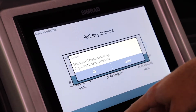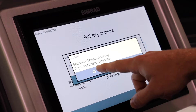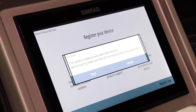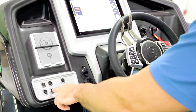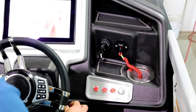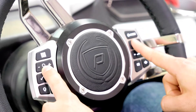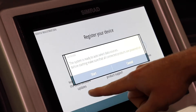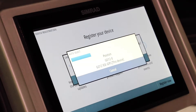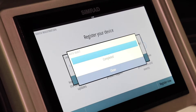The next prompt is the network asking for data sources to be set up, so we'll click OK. The system is ready to auto-select data sources, but before starting make sure everything is powered on. We want the stereo powered on, the engine key switch in the on position so the Simrad can find the engine, the steering wheel lit up properly — anything on the NMEA network should be powered on. Once everything is powered on, click start. It'll go through initialization, auto-select everything, and save you a ton of time configuring things later.